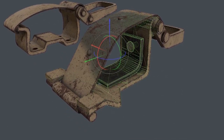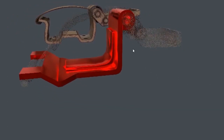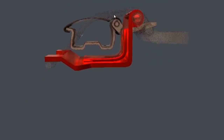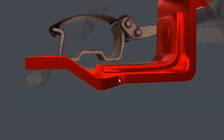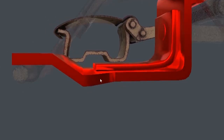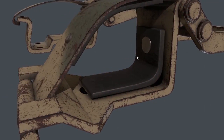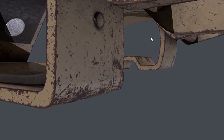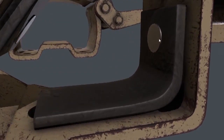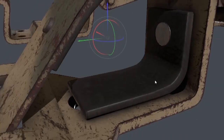On a Type 1, the base is a fork shape from the top, and in the back it comes up and kind of wraps around like a P shape. They usually have a varying degree of shift from this section up until the final section where the little rod goes through. These also have a piece of leather riveted to them, which is different than Type 2 — Type 2 does not have that. They use these sort of silver rivets that come out the backside a little bit.